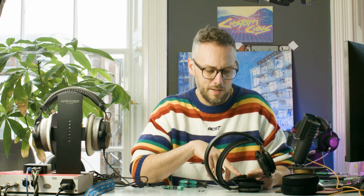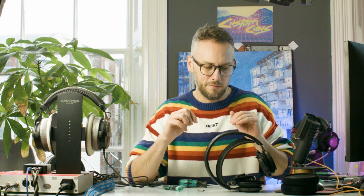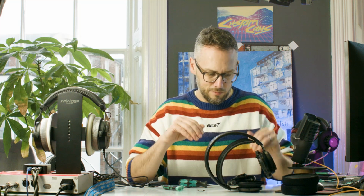I might also have a bit of an experiment with these and see if we can come up with anything, because I suspect adding a bit of weight always helps with sub bass, so we'd add a bit of weight to the back of the driver, maybe reduce that hole, so we'll bring up the bass using the weight, reduce the muddiness hopefully by closing that hole up, and then maybe some of those peaks and troughs in the treble might be caused by this enclosure. As I said, it would spread it out over a range of frequencies, but that curved section there might be causing one of those peaks and troughs in there, so we might fiddle around a little bit, see if putting some damping material or some shaped pieces in there might reduce some of those resonances. Trial and error kind of thing really. Just try a few things.